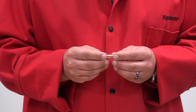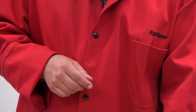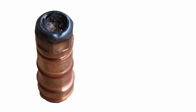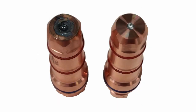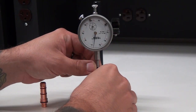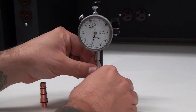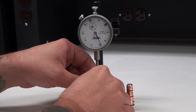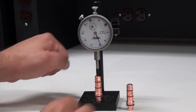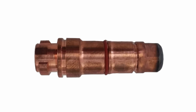The final consumable is the electrode — the contact point of the cutting arc. Always use the tightening tool when installing the electrode. Electrode damage is commonly due to over-usage, incorrect amperage setting, low coolant flow, or incorrect gas type used. When inspecting the electrode, look for emitter wear in the surface of the electrode center. Using a pit depth gauge, measure the center pit depth to be sure it is not greater than 1 mm or 40 thousandths of an inch. For 300 amp mild steel electrodes, replace the electrode when the pit depth is 1.5 mm or 60 thousandths of an inch or greater. If an electrode needs replacement, always replace the nozzle at the same time. If O-rings are damaged, replacement is needed.